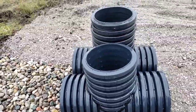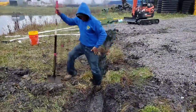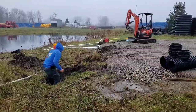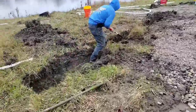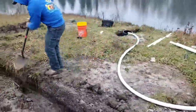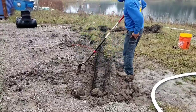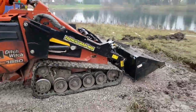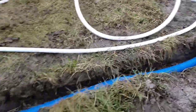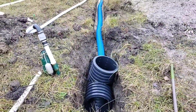Plus, we're going to use two different size chambers. We're going to put in a shallow chamber, and we're going to show you water backfeeding. I'll give you a little bit of a play-by-play on the ground, and then we're going to dig out the sump pit to a deeper depth, and we're going to put in a much taller outdoor sump pump system, and we're going to show you guys the difference and how there's no chance at all that you're going to have any backfeed into your French drain, yard drain, roof runoff system, whatever it is that you're dewatering.